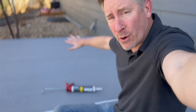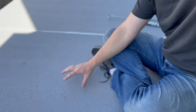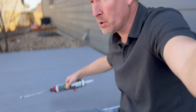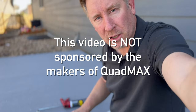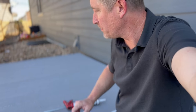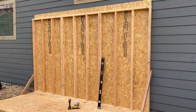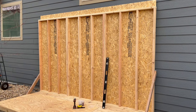I've got the back wall built. I've put the back paneling down, and I'm using the lesser expensive paneling — this is like 30 bucks instead of the others that are going to be on the sides and on the front, which are like $40 to $45. It's more of that shiplap look. I'm also using this Quad Max sealant. Supposedly it does a better job in colder and wetter environments — seemed like a pretty good thing for waterproofing. We'll get that last row done and then get this wall stood up. The back wall is up and I've got one more top plate to put up there — we're going to do two top plates on each wall.